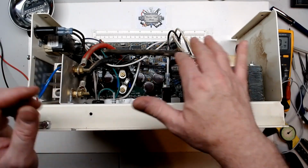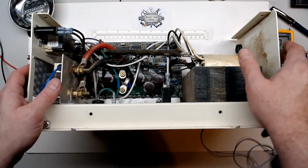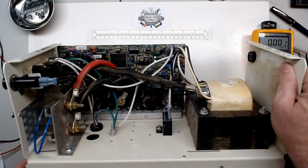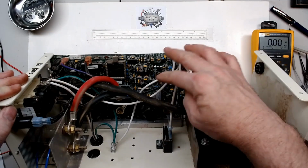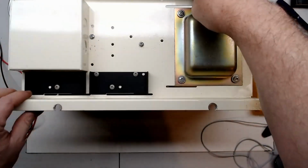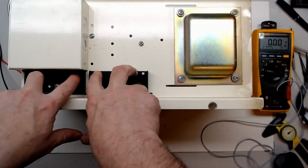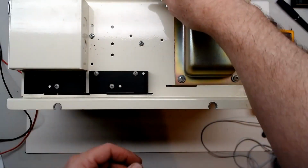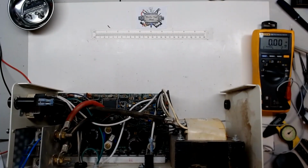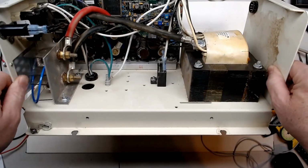And then I'm going to look into repairing these caps. So I'll be back after we get the board out. It looks like I just got to, of course, take these wires loose and document. And we have some heat sinking and 6 Phillips screws here that goes on to that aluminum channel where those MOSFETs are for our transistor heat sink.